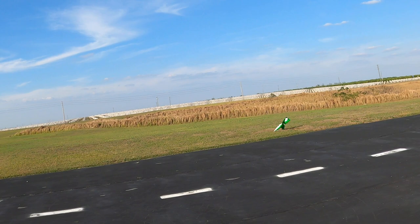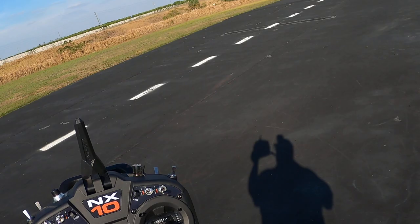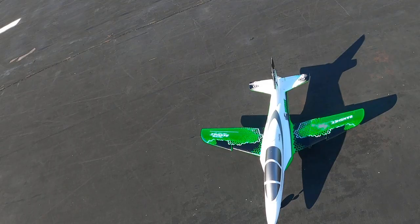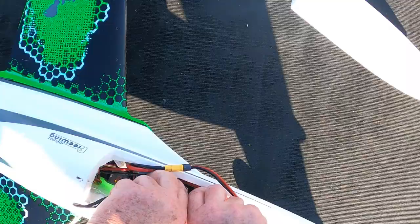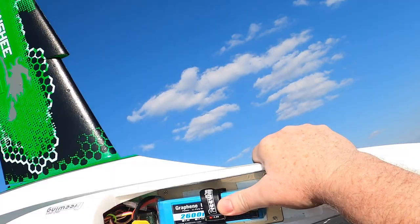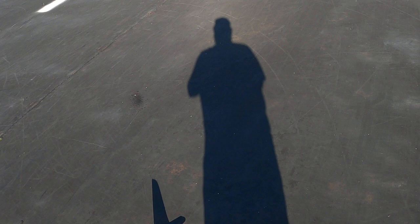Bouncy, bouncy. Luckily, this is where a light plane — motor off — this is what makes it nice, because they're light. And this one's very, very strong. Alright, that was a three and a half minute flight, minus 15 seconds, with... I went down and did a range test before I even started filming. So, battery is relatively warm, but not too bad. To show you where I've got that graphene — that's a graphene YOWU 2600 4S with a 130C discharge. She's got a fast discharge on her, so she'll deliver a lot of power very quickly to that EDF. But let's see what kind of juice I got in the tank, as G.B. Linden likes to say.